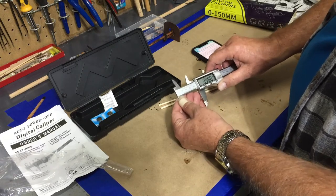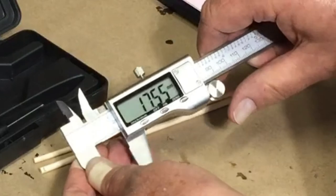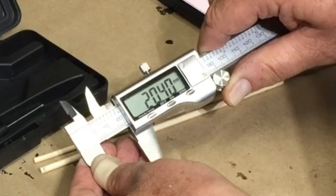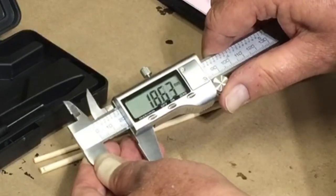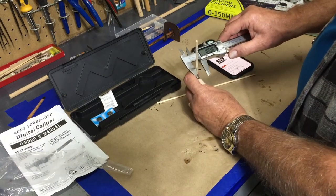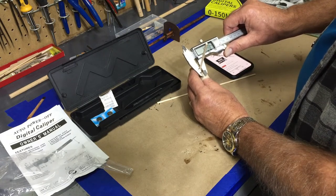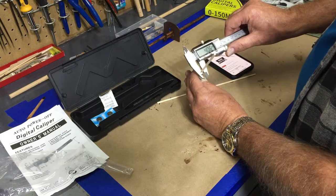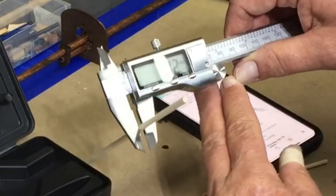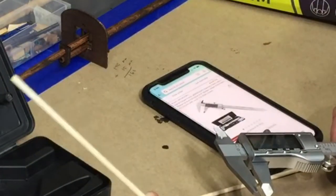The other thing I like about it is you can manually pull this to where you want, but when you get into the micro size there's this little thumb dial and you can slide it to very gradually take it up or down. Because I use small items, this dowel rod for example — which should be about four millimeters — using the thumb dial, it comes in at 4.02.